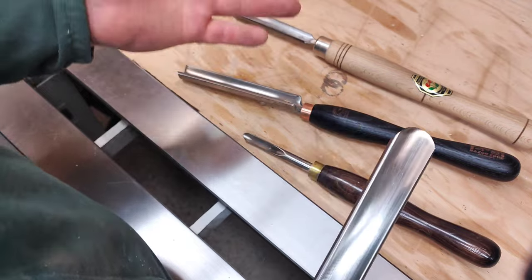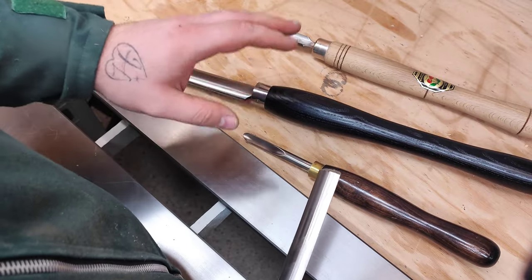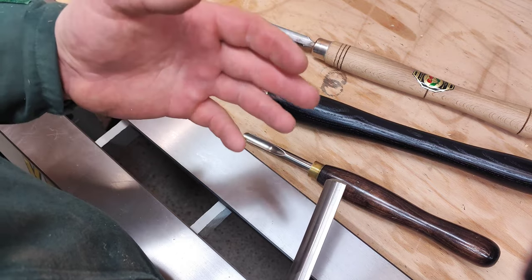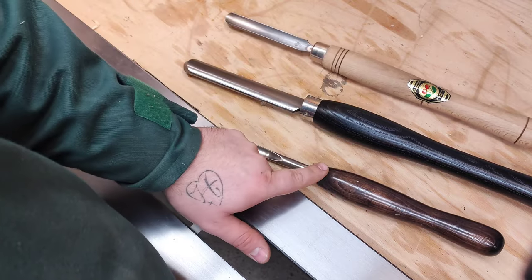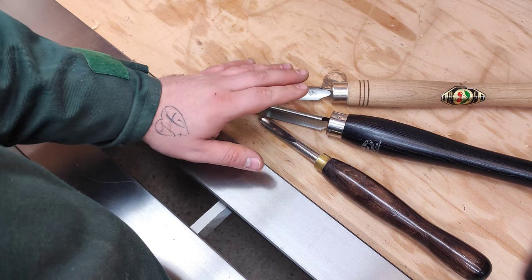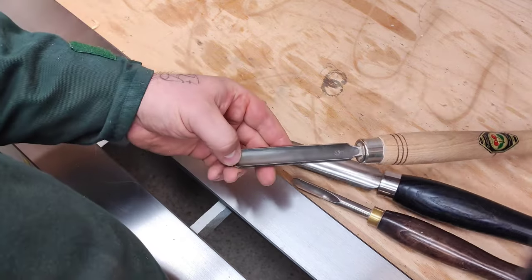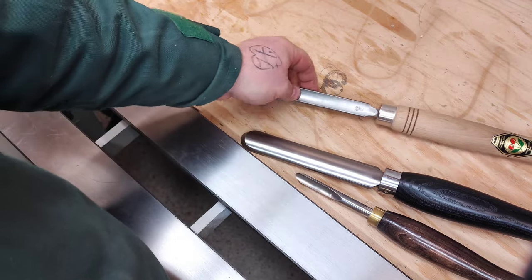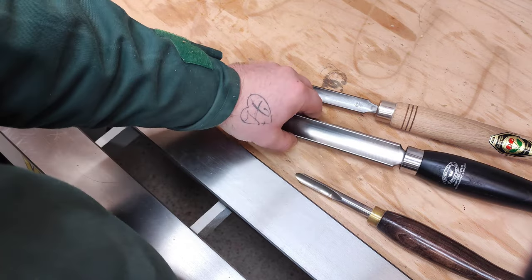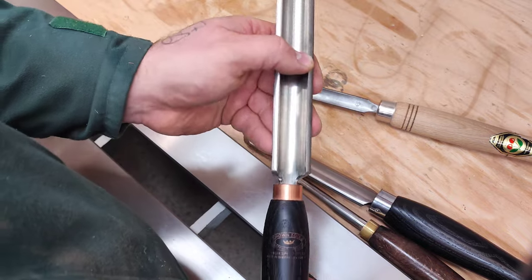Until recently — maybe the last five to ten years. So you can imagine these were used quite extensively. I did get a few questions asking why I used spindle gouges when another turner said it's not to be used on cross-grained work. So a regular spindle gouge with the shaft and these continental ones can be used on cross-grained work like balls. The ones with the round shaft are much easier to use.